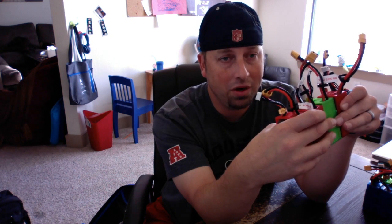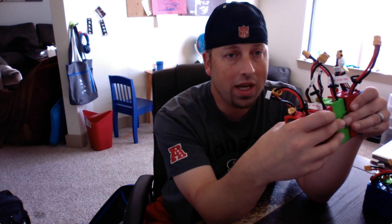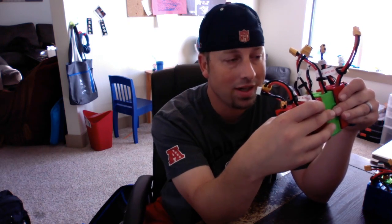Now, I already just, in hearing that, if I was new to hearing that, would instantly think to myself, well, what about the charger? Like, I mean, it's only meant to charge one battery. You're going to overload it, right? Well, yes, you could charge a larger milliamp battery and all that, and you're not overloading necessarily the hardware. But let's say you have a dual charger and you do this twice, and you've got 6 2,000 milliamp batteries on there. I mean, in theory, yes, you're putting a lot of strain on the components.